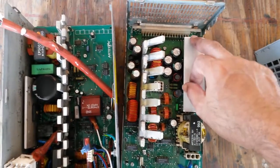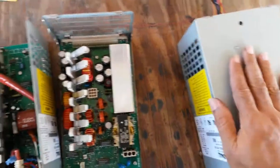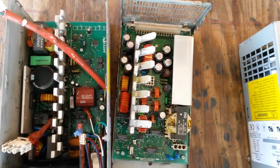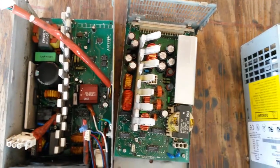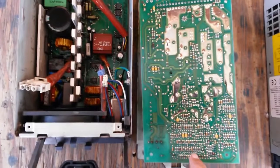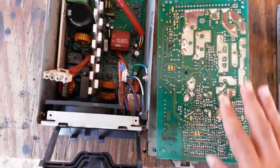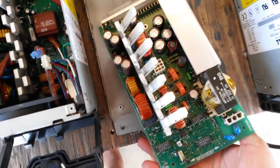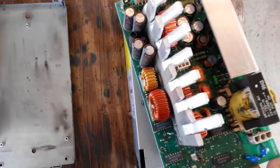Let me take this whole thing off, turn it around, and see if I can figure out what's going on. Just by directly measuring I'm getting some answers — I'm getting the fan to come on, I'm getting the light to come on. But I cannot put both of them on at the same time, and neither one is giving me proper voltage out. There are standby voltages, but nothing else. So figuring out how to turn this on is more complex than I initially thought. On the side of the board it's mostly tantalum caps, diodes, and resistors — pretty much passives all the way. The only ICs I can see are comparators. I'm not seeing a microcontroller anywhere, so it seems this thing is really just pretty much analog logic.